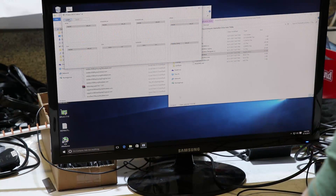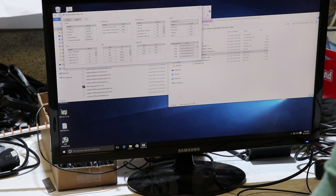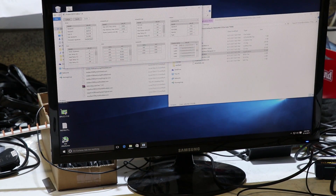Open the Red Devil Hynix model — this is the ROM we use. What you need to do: there are two sets of timings. You need to copy the timings from the first set at 1750, and paste them into the second set of timings at 2000 and 2250. To recap: copy the timings from 1750 in the first set of timings, and copy them all to the second set of timings at 2000 and 2250.